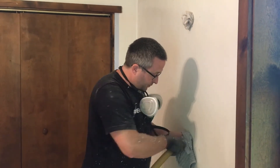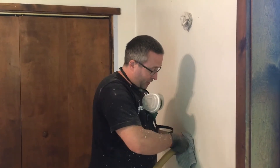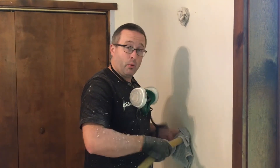When you shove it in and pull it back out, shove it in and pull it back out, you're pushing the insulation beyond its natural density, and now it won't settle. So this is really critical.